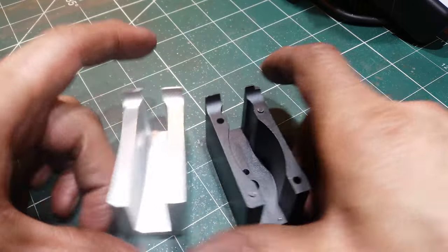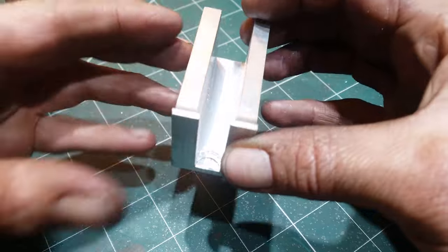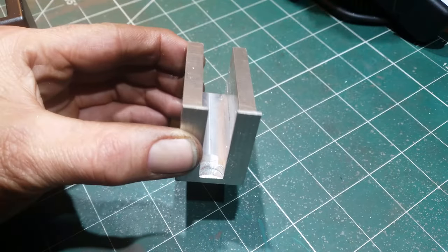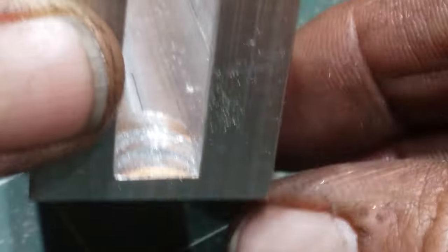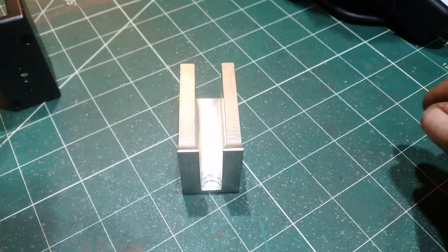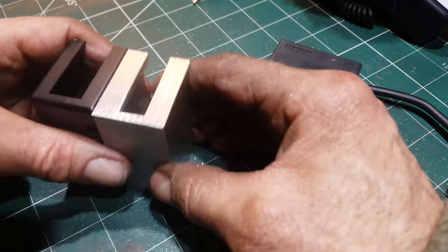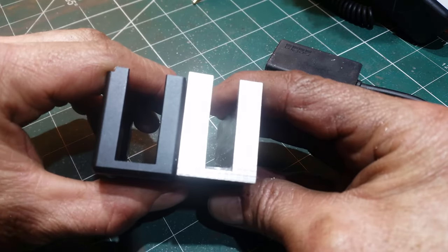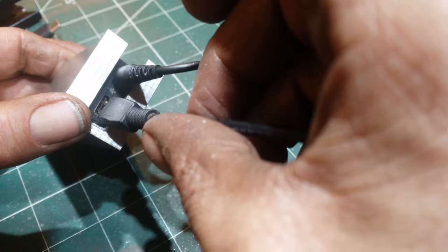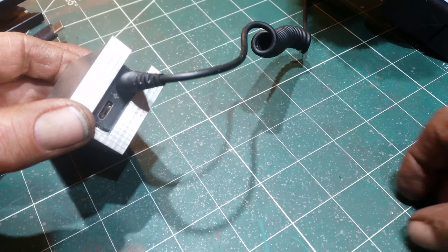Okay, here's a bit of a timeout just to show how far we've got. Those dimensions are good. But once again, I forgot to tighten the head down and it pulled itself into the job. So that's a shame. It is, however, still usable. And that, of course, is our watchword. So now, even though that gap is not as big as the original end gap, as you can see, there's plenty of room there to get our different connectors in.